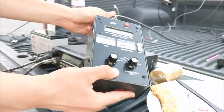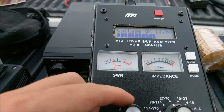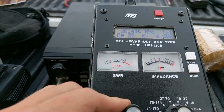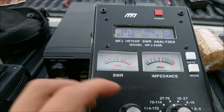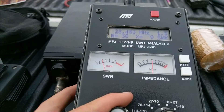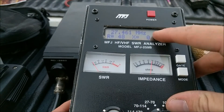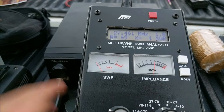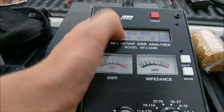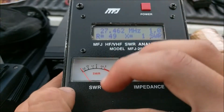Let's try the antenna tester first. As you can see, when I turn it on and tune it to the right value — 28.385 MHz — the SWR is about 1.2. It's not the best but it's pretty good; this antenna isn't perfectly matched. If I tune down more I can get the SWR to 1 at about 27.461 MHz, which I can still do on this radio, it's just not the frequency I want to transmit on.